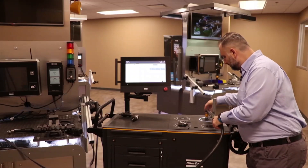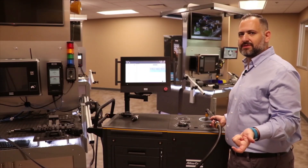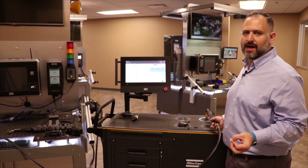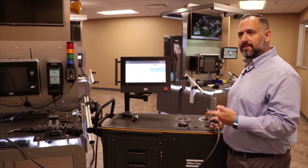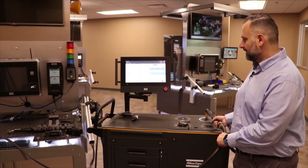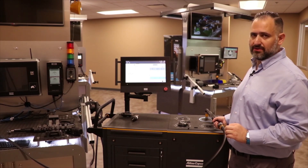To test the tool I simply need to wait for the blue light to come on here on the screen. You will see that between two rundowns I'm virtually waiting for no time at all. This is because the hydraulic system on the bench has been improved to the point that it takes no time between two different rundowns to be ready. This means I don't have to back up the tool — I'm ready to go as soon as the blue light is on. This is the fastest system in terms of waiting time between two rundowns currently available on the market.